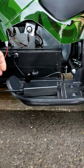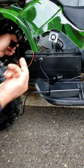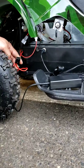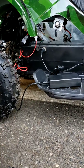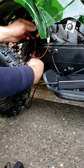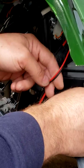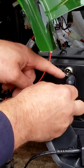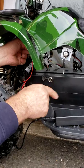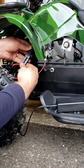When you plug in to your batteries it's going to make some noise even though the battery plug is not connected. Ignore that clicking noise — that's only because the ignition was on. Your batteries are recharging only when both plugs are in. Now remember you have 41 volts coming from the charger. This voltage goes into the charging port and it's not attached directly to the batteries — it goes to the machine's controller and from the controller it comes back to the battery pack.